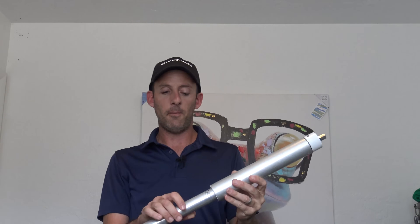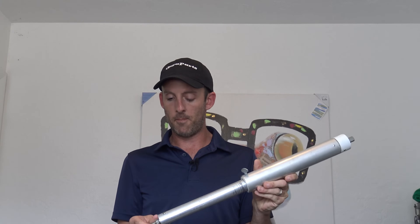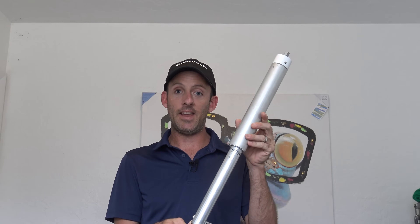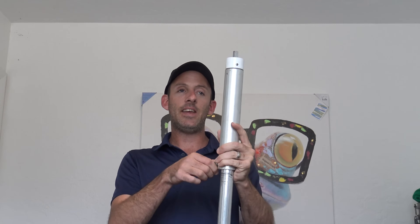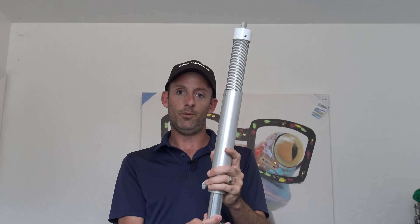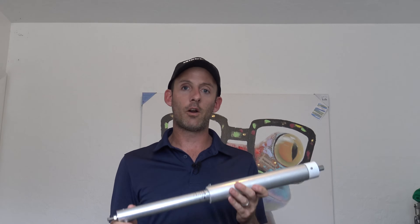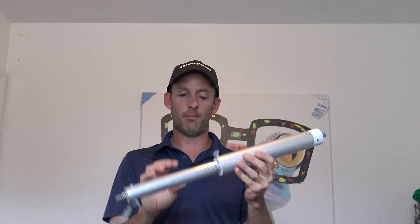What's happening is this uses your car frame or body as the counterpoise and the antenna itself moves. If you're new to the hobby: the lower the frequency, the longer the antenna. The higher the frequency, the shorter the antenna. That's why a 2-meter rubber duck antenna is real small and an 80-meter dipole is roughly 134 feet — the lower the frequency, the longer the antenna.